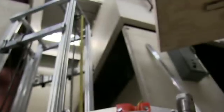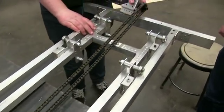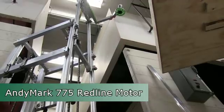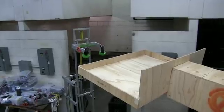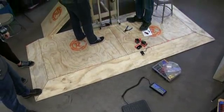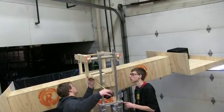This is our power cube elevator. To build this mechanism, we used the elevator kit from REV Robotics. To reach the height needed for the scale, we went with a two-stage elevator. The lower portion is controlled by a Redline motor donated by Andy Mark, attached with a chain. For the upper portion, we used a nylon strap connected from the first stage top bar to the carriage which carries the power cube. We're using a single-stage climber donated by Andy Mark, driven by a VersaPlanetary gearbox geared at 147 to 1 with a 775 Pro motor.